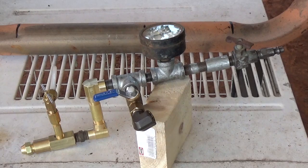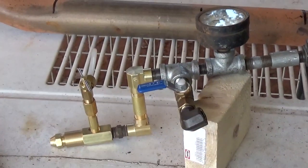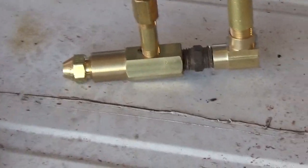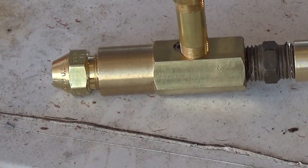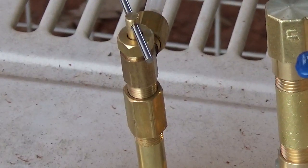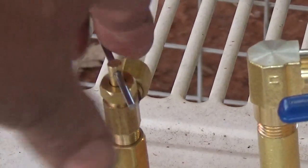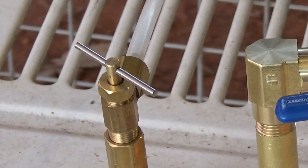It's a siphon nozzle for a waste oil burner. I'll try to leave a link in the description for that siphon nozzle — I got it at Patriot Supply. You can get the nozzle and the adapter individually, and they do have some grouped together. It comes out with an eighth inch pipe, goes up to a little needle valve, and that's going to be my siphon hose. I just put a short piece in there.